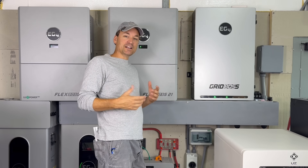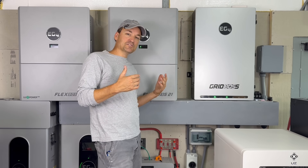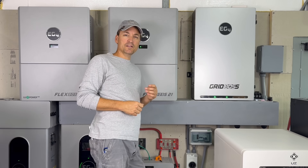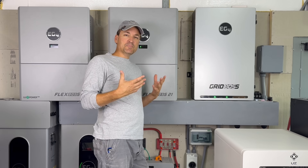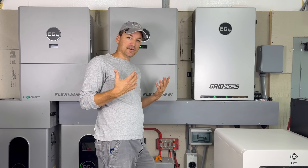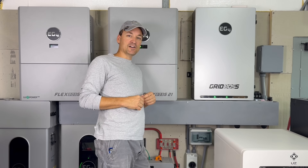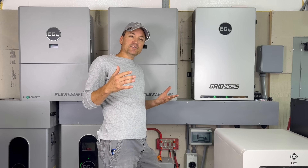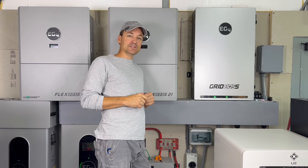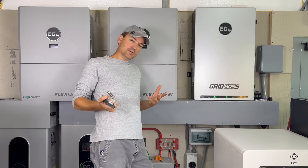Both Flex Bosses are at 440 volts usable; the 18 kPV and 12 kPV are at 500 volts. The amperage limit did go up on these newer models. My largest array is wired into the Flex Boss 18 at right around 500 VOC and I haven't seen any losses since I switched from the 18 kPV - same exact power. They may just be a little more conservative with their numbers on these newer MPPTs. If you have questions on how many panels to put in a string, go to that calculator - I'll leave a link in the description.